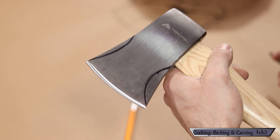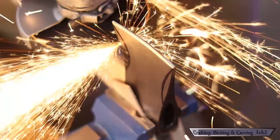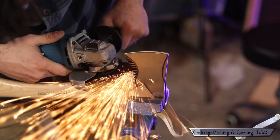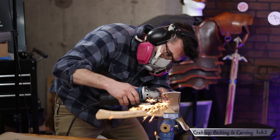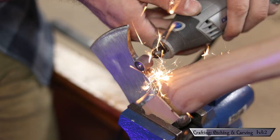The thought was to use my angle grinder with a cutting wheel to plunge in up to my mark, leaving little fingers of metal behind. Then using a grinding disc, I just grind those little fingers away. By using that plunge cut to remove a lot of material at depth, it makes it way easier for my grinder to go up to that point I want — this way I'm not grinding too far past my mark. Finally, I cleaned up that space with a grinding drum on my Dremel.